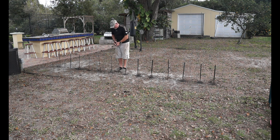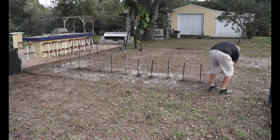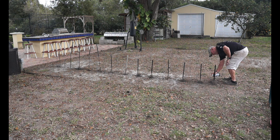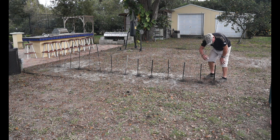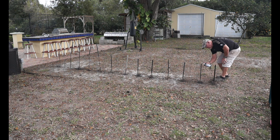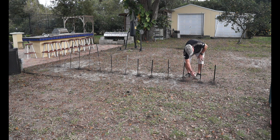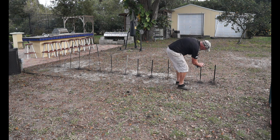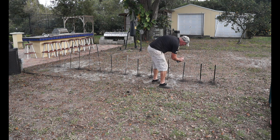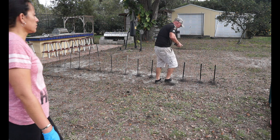The vertical supports were at the same dimension as the horizontal studs in the building, which were on about 40-inch centers. Here I'm using some number one or number two rebar hammered into the ground and sliding the half-inch steel pipe over the rebar — it makes it easier to paint. I can paint it and let it set up. The paint I used was a flat black with primer, something you can find at the big box stores, and it worked out really well.